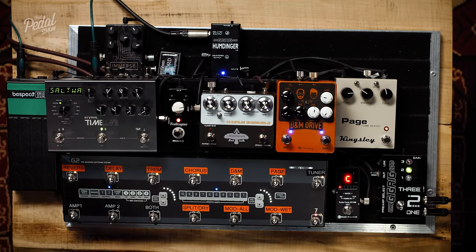Sometimes, with the signals that are after the splitter, when you kick those on, you might find that your sound gets a bit weaker. Sometimes the pedals themselves flip the phase. So imagine that we've got our wet dry setup and we're push-pulling, everything's lovely, and the splitter's here. We're push-pulling, and the pedal that I turn on to go to my wet effect now does this.